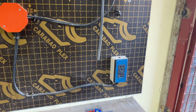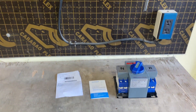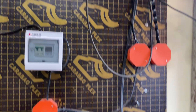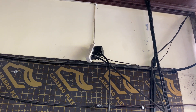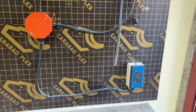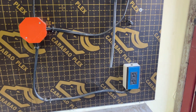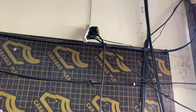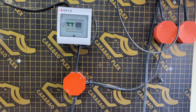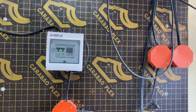From here, we're currently in the process of changing some things so we can have an automatic switch. Up until yesterday we would manually unplug from AC in the morning when the sun came up and switch back to solar, then when it got cloudy and the battery bank ran down, we'd plug it back into AC in the afternoon. We want something more automatic — when the battery gets to a certain voltage level it'll automatically switch over so we don't hurt the batteries and we keep those pumps running.